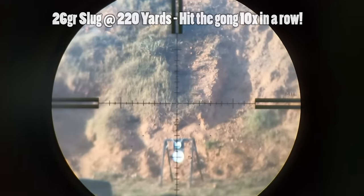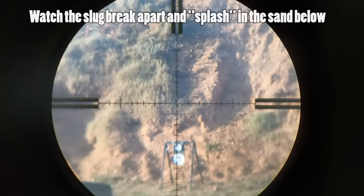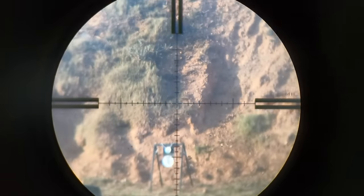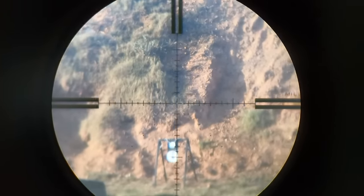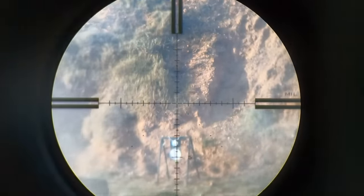I can tell you for a fact that the barrels themselves are very, very consistent. I know this because when I went to the FX factory in January, we tested probably about 100 different barrels from the same batch, and every single barrel shot exceptional groups, but it took some time to set the gun up beforehand to get the right balance in power, to get the right velocity for a specific weight slug. Once we did that, no issues. Obviously, there are going to be very minor variations, so we did need to test different weight slugs and .217 and .218 to find where the sweet spot was for that batch. But once it was set up, there were no issues.